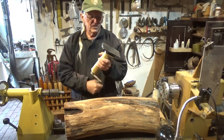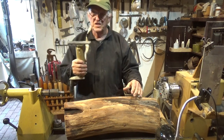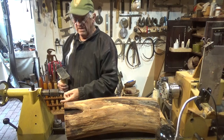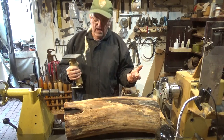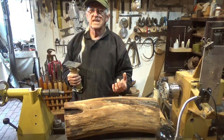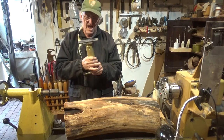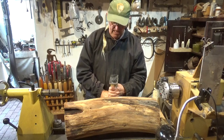The piece of wood is already sitting on the ways. This jack will only work on a lathe that has through ways — what I call through ways — because you can reach in from the bottom and mess around with your lock nuts and bolts on your headstock, tailstock, banjo, whatever. Robust has the one-way and there are a couple others with the ways sitting on a big tube; you can't use this jack with those. I designed it to drop in through the ways, then twist to lock it into place, then I can start lifting.